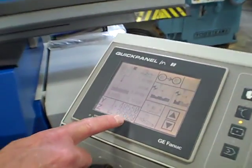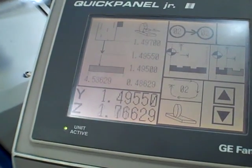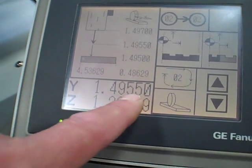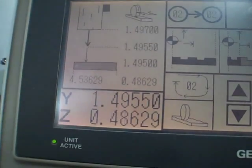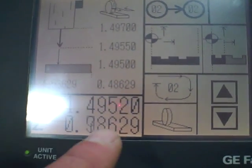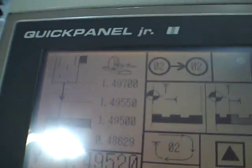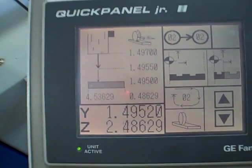Now, that said, you can see it switch over one time here probably. And as soon as we traverse all the way to the end, it's going to jump another 5/10. We'll go to 4950, which is our target number anyhow. There. Now we're going tenths. Yeah, we're going 2/10 or 3/10 at a time, I think. So that's it. Pull back a little bit. We've only got 2 more tenths, and the cycle will be finished.